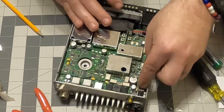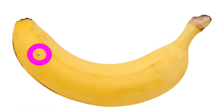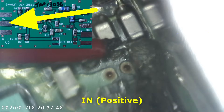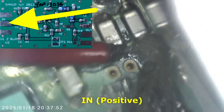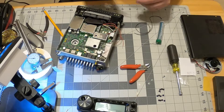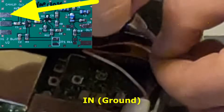I guided this to the outside of the board. Now, using a banana for scale — you're about to be doing some tiny stuff, legit tiny soldering. Be very careful at this point, do not exert any pressure. If you have a way to magnify it, that would be even better. We're putting it right there on those parts — these are two capacitors and one resistor. The tip of that wire is literally how big two of these are. The positive input to the HupRF board is coming off that IF tap right there at 69.450 megahertz.